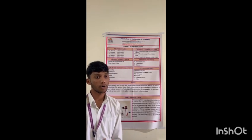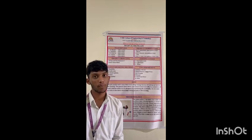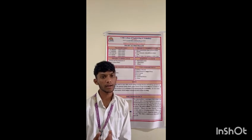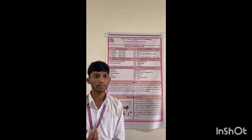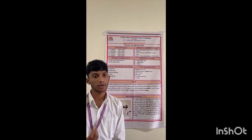The current overall design is classified into two parts: the hardware section and the software section. The hardware section consists of the Arduino, breadboard, buzzer and vibration motor. The software is based on code. The basic working principle of the alarm is that it works on code and uses alarm timing so that the buzzer makes sound at intervals. The alarm is set by the user and can range from seconds to hours.